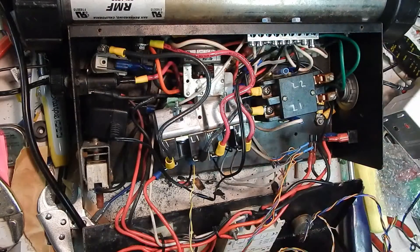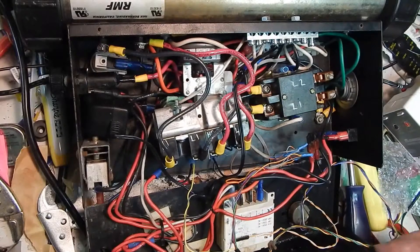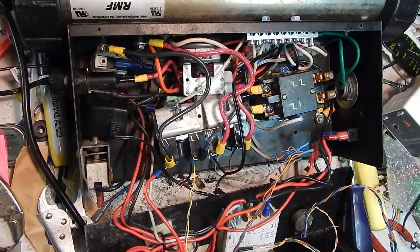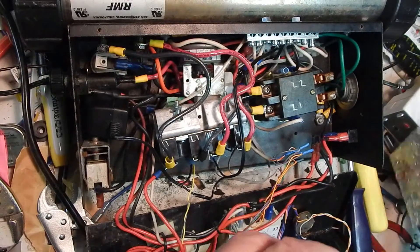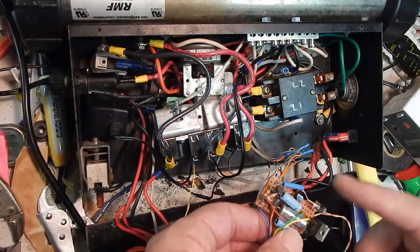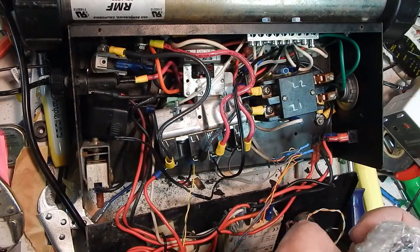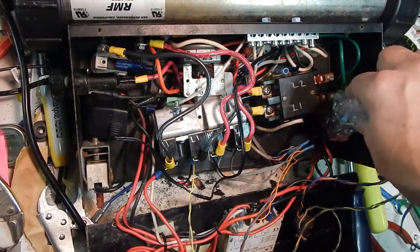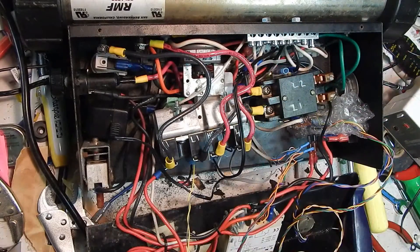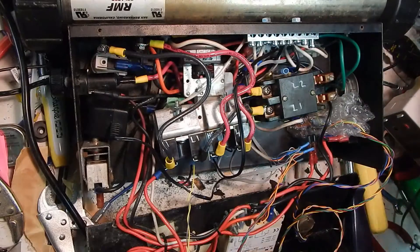Originally they did go straight, but I let it relax a little because it makes it easier to get to this relay anyway. This relay is angled so I can get just enough clearance for that switch. For the first time in a long time I'm able to close this box up. I rewired this little circuit and even put an LED across where it would normally turn a relay on if it was working — just because I don't even know if the circuit has any status at this point. I'm not using that to control the relays; just hooked it up for fun and giggles and to get that 5-volt regulator working.